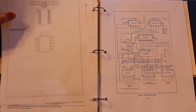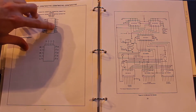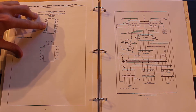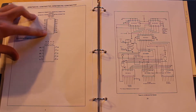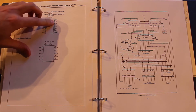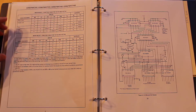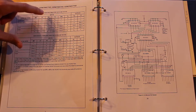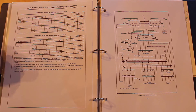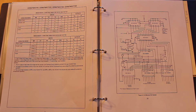Looking at the pinout of the 74HC163, we get P0-P3 and Q0-Q3: our inputs for loading and our outputs for the binary number we're outputting. Then we have a bunch of other pins — MR, CP, PE, TE, etc. Fortunately the datasheet has a handy little chart that shows what each of these inputs or outputs does and how to set them up to achieve what we want.